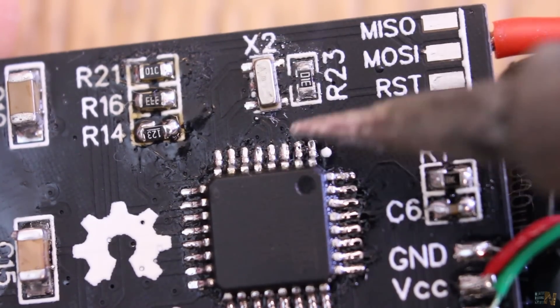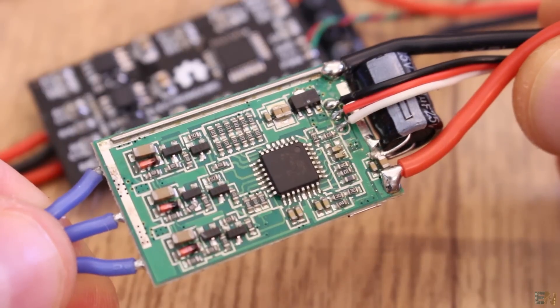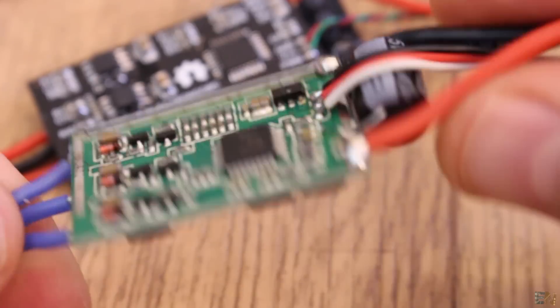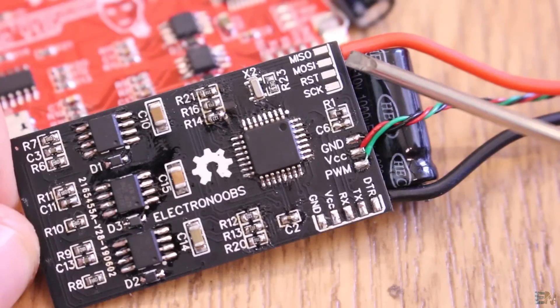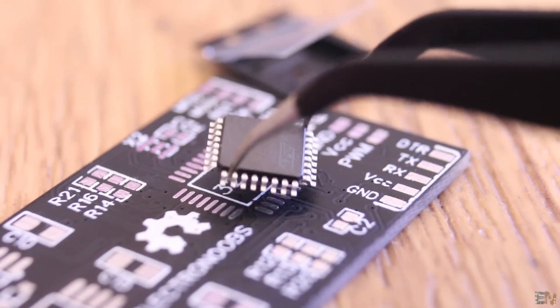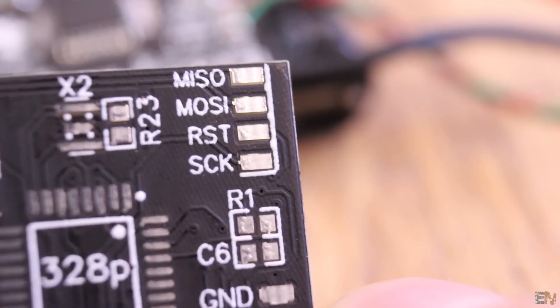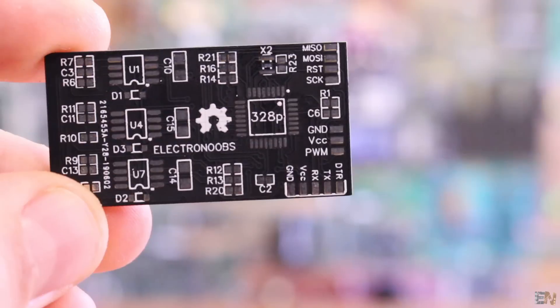Here I have a commercial ESC that is using the Atmega 8 and is about the same size — I can see no programming pins, so the chip must be programmed before being soldered to the PCB. I've also added the SPI pins in case you need to burn a new bootloader. Imagine you order this PCB, solder all the components, but have a brand new Atmega 8 with no bootloader — you also have these SPI pins to help with that.